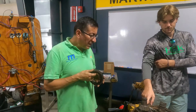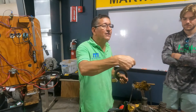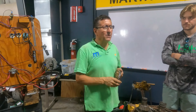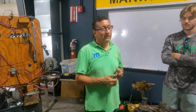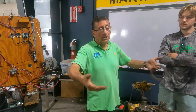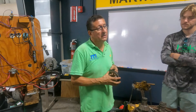If you check the oil in this transmission and immediately find milky oil, where is the problem? Most likely the transmission cooler — the cooler is leaking. Or in some cases, a lot of water enters the bilge of the boat and reaches the level of the transmission.